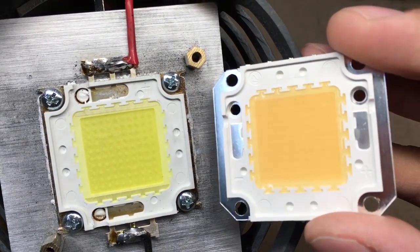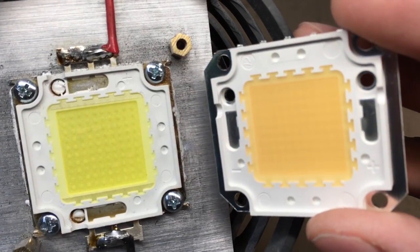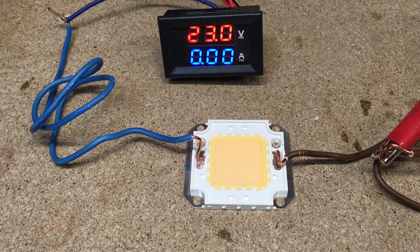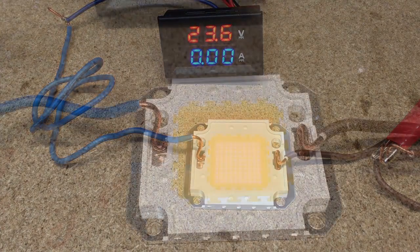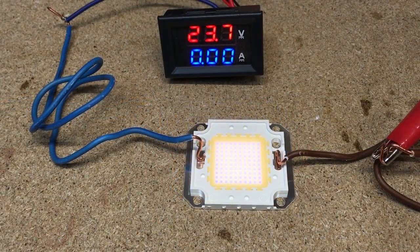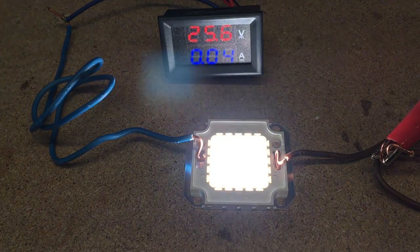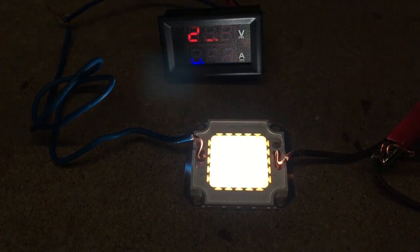Before installing Yuji's chip to my flashlight, I'll give you a great example of how to identify poor quality LED chips. A good quality LED chip, like this one from Yuji LED, must start operating from a specific voltage — in the 100W LED chip case, from 23V. All 10 by 10 small LED rows must start glowing evenly with the same intensity of light, and when voltage and current are increased, all individual LEDs must outshine evenly too.